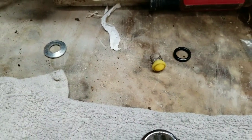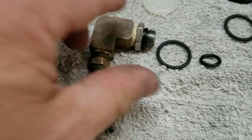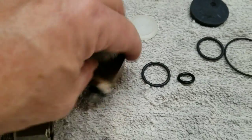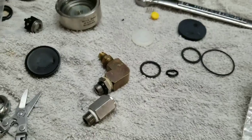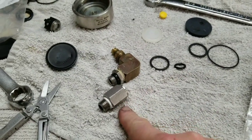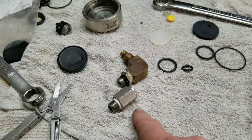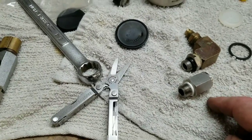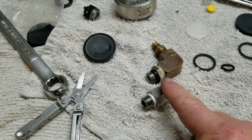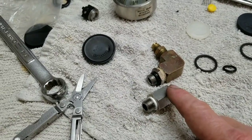What I'm doing is just keeping the old parts over there. Got the new check valve in there, got the new o-ring on - I'm just going to put those two together and tighten them up. This is actually doing really well. I have not rebuilt this chemical pump - this is a 2011 with about 3,400 hours on it. I've had to replace these domes on the rubber parts a number of times, but this is the first time I've replaced these in - it's 2017 - so six-plus years. Pretty cool.